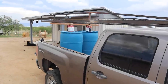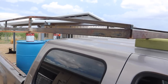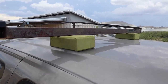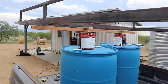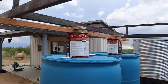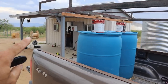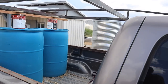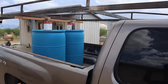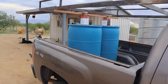The milk crates did not work out too well - it was just a little bit too high. So what I did instead is use some yoga blocks as the spacers on the front, and then I used some paint cans on the back with a couple of boards. I've measured all four corners and the angle sitting on the bed is about 23 and 5/8 inches. So I'm going to cut those, tack them into place, and I'll probably do all the rest of the welding once I take it off, then I'll paint it.